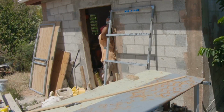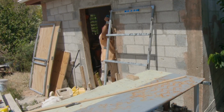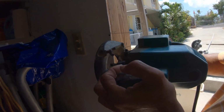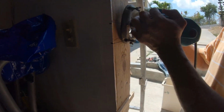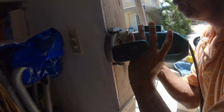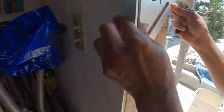Now I have to make a little groove for those little pieces of flat bars I placed on the frame, and that's what I'm doing there. I'm going to do this one. I draw a line. The line is about 2.5 inches, about half an inch wider, so it will give me enough space, enough leverage to bring the frame up or down. Make sure everyone lines up, and then after I put that little 2.5 inch space, I line up the router there,